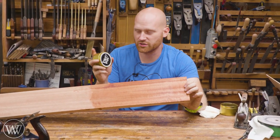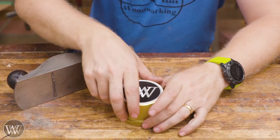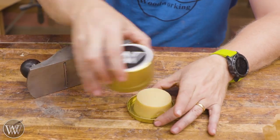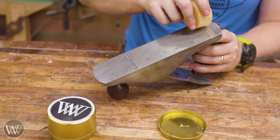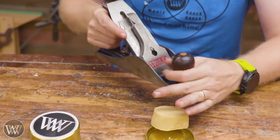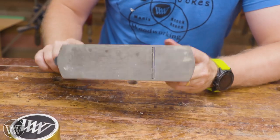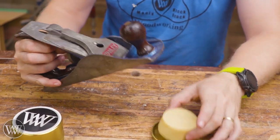My soft wax is what I go on top of most all of my finishes — whether it's a poly or some other film finish. It seals the pores in and helps fill in any small imperfections, really giving you that nice sheen and the glow you're looking for in the wood. For my hard wax, I like to keep it in the lid. I'm going to use it on the plane — just like that, a really nice clean layer of wax. This makes the plane move incredibly smoothly across the wood. If you're working with any dense wood where it's grabbing or catching, it's incredible what this will do. This wax lasts a lot longer than oil — it has the lubrication of oil but the long-lasting of wax.